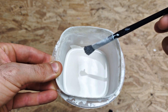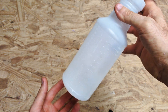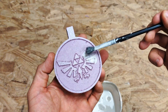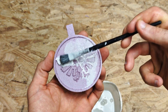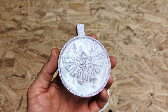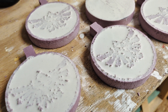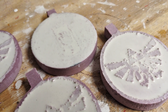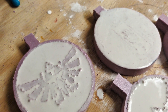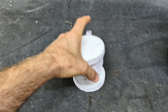The joint compound is used to help preserve the smoothness of the foam and kind of get into all the smaller spots. But before applying the joint compound, I sprayed it down with some soapy water. The soapy water is used to break the surface tension between the foam and the joint compound. Coat the entire thing and let them sit for 24 to 48 hours to let them cure enough to cast in metal.